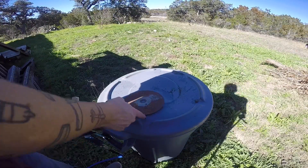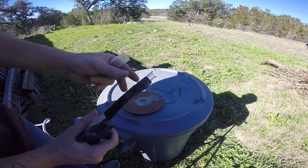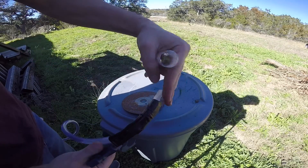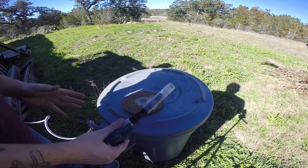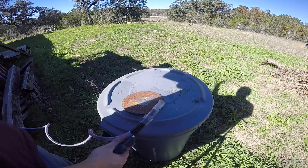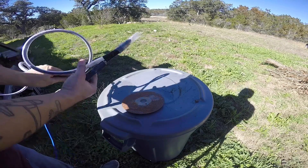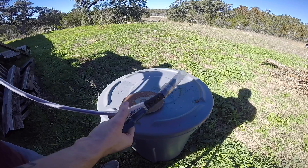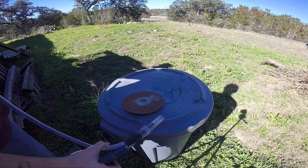I came over here to the back porch. Hopefully this comes out okay — you can see I've done a little bit here. I changed it just a little bit — I wrapped it in tape so I get a little bit more of that Bernoulli effect, and I cut this on a bit of an edge. I just shoved this in here to help direct everything. I've noticed it works best if the bucket of sand is above the nozzle and the line is as straight as possible. As soon as the line starts getting curls in it, it doesn't want to flow very well. In this configuration it seems to work okay — let's give it a shot.